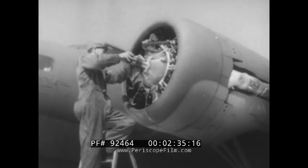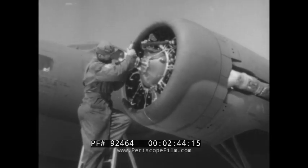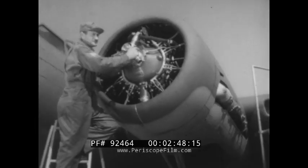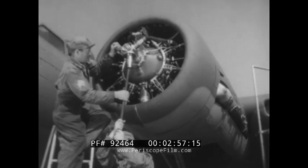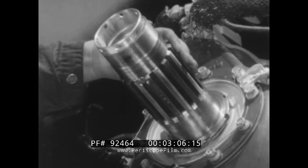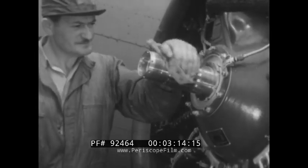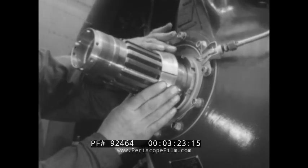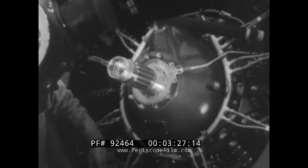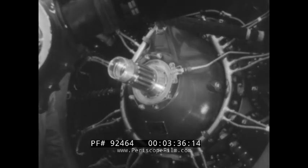The cloth and metal cap protecting the shaft threads has to come off. A condemned prop spider comes in handy in turning the shaft. Now give me some help so we can turn the engine until the bar is straight to the ground. The shaft is turned so that its closed spline is down, matching the position of the open spline in the hub of the prop as it hangs from the hoist. Mel cleans the shaft carefully and also the heavy bronze cone, which is the first thing that goes onto the shaft. This split cone contracts and grips the shaft tightly when the prop is pushed back against it, making a firm foundation for the whole prop assembly. Mel is careful not to get oil in the cone as he lubricates the shaft. He slips a metal guard over the threads so they won't be damaged when the prop goes on later.